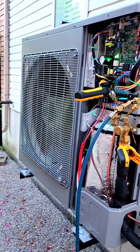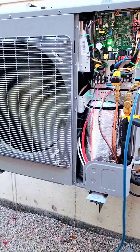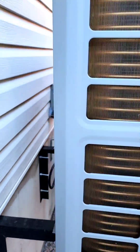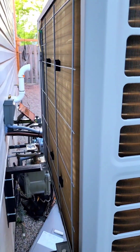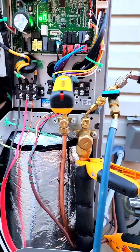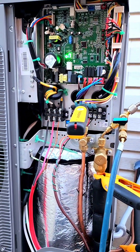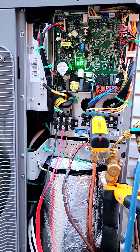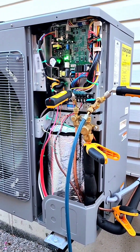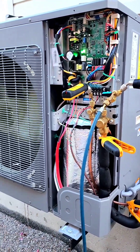It really depends what you want from this heat pump. As you can see, it's very quiet. It's a nice looking heat pump — side discharge. This is the condenser. I had to add some refrigerant to the system to adjust the subcooling on it. But all in all, this is how it looks and how you have to hook up your wires. There's nothing crazy about it — as long as you do the proper insulation method and use all those materials, you're going to be fine.